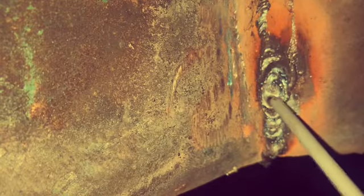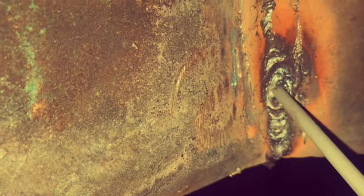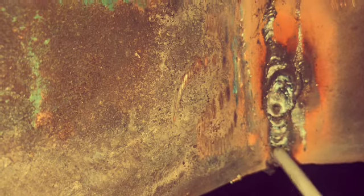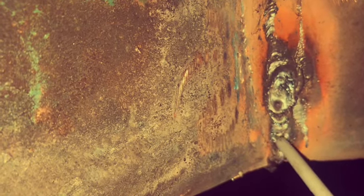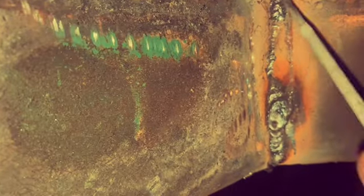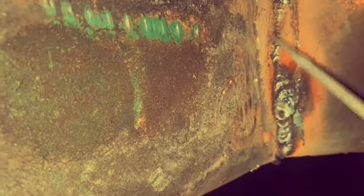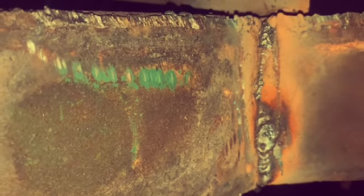Here, I've got this ugly fisheye because of contaminated steel. You had some welding inclusions. I'm annoying myself because I kept clicking that rod on the steel. I don't know why I did that, but I'm continually doing it. Got hydraulic fluid. The hydraulic fluid was all in this steel. So that's just something to consider. The weld is ugly. We're going to grind it out. Every time we grind it, heat it, weld it, it gets a little cleaner, gets a little better. So that's where we're at.